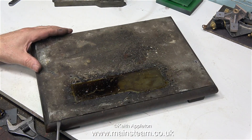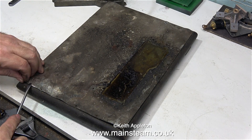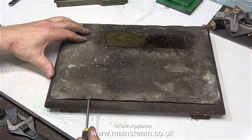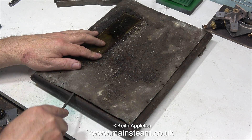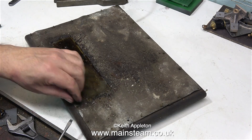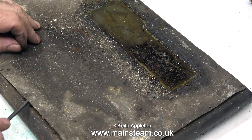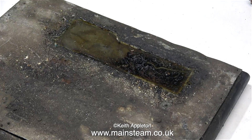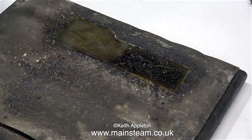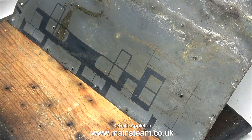Over now to the baseboard, and this is a bit of a curiosity. It has a very thin piece of sheet metal on top of the wood, and I was surprised to find that this thin piece of sheet metal is held to the wooden baseboard using some small brass pins around the outer edge. But once I removed all of these, it didn't come away from the board — because apart from the pins around the edge, there are also quite a few carpet tacks which hold the piece of metal down to the baseboard. This is in the area where the boiler was, so I think what must have happened is that in the past, the piece of metal warped with the heat from the boiler and became uneven underneath the boiler where the burner went. So the multitude of carpet tacks were just to keep the piece of metal flat.